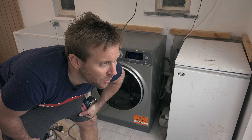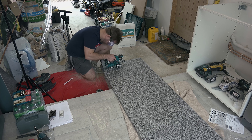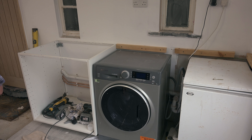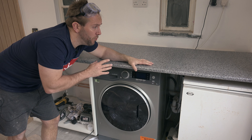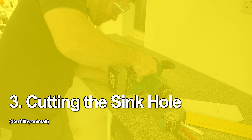What I always do is measure from two points — the front point and the back point — to the front point here and the back point there. Fortunately both those measurements are exactly the same. I also have to account for the end panel going on and a bit of an overhang on the worktop just because it looks nice. So I think we're going to go to 2130mm. Now I've got the worktop in — it's a little bit bent, it's been leant up against something in the store — and I'm going to have to figure out workarounds to get all this in properly. We've got our worktop on, our pipes in, our carcass back and fixed, and we're ready now to get our cutout done for our sink.